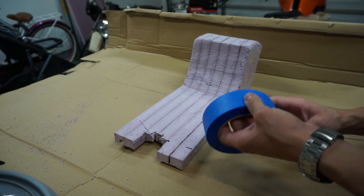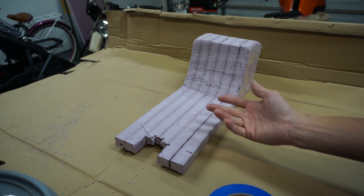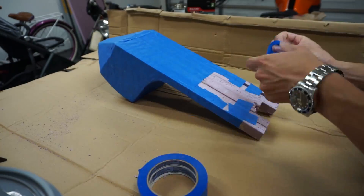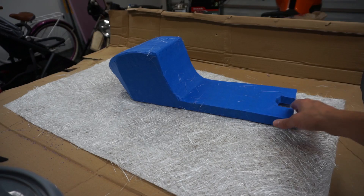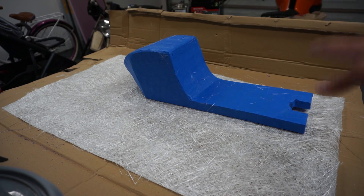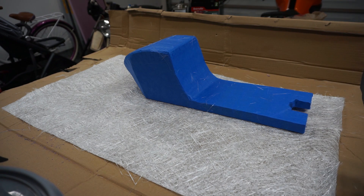In order to save the mold once I put the resin on it, I need to cover it in some tape, from the videos I've seen. So I'll cover this all in tape and then put some car wax or beeswax to act as a release agent. I've covered the entire seat in blue tape. I'm going to lay out and shape the fiberglass mat around the shape of the seat, and then apply resin so I'm ready to go and it doesn't harden while I'm working.